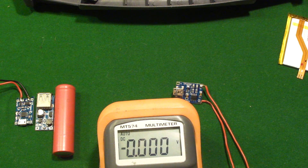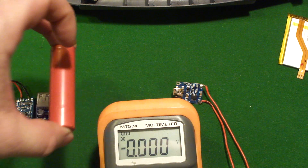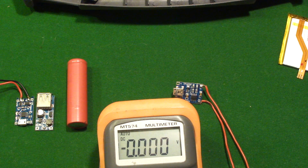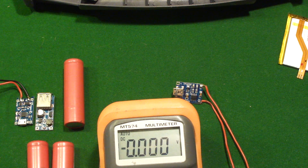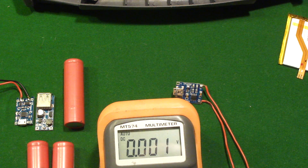Using these modules, you don't have to worry about all the complexities of charging and discharging lithiums. The only thing to be aware of is that you don't discharge the lithium too rapidly — one little lithium powering a very large motor could overheat the battery. But for powering LEDs, small motors, Arduinos, and whatnot, one of these batteries is fine. A few of these batteries is great. For larger motors you can start putting four-packs together, or even putting four-packs in parallel or series to make huge amounts of amp hours available to the project.